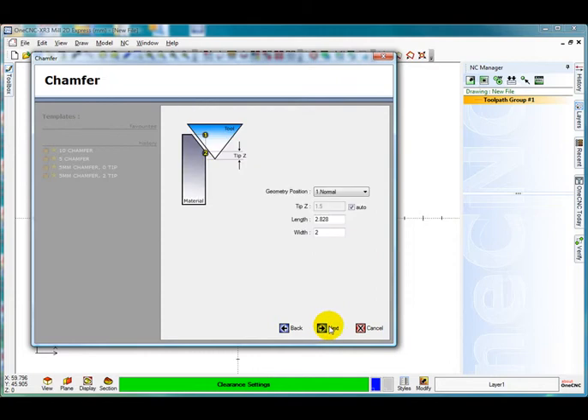Now this is the area in question regards the chamfering tool and what 1CNC does is it looks at the size of your chamfering tool. You can imagine that is the diameter and you have got 45 degrees — the angle down the side there. What 1CNC tries to do is find the sweet spot between the length of this chamfer here, so it can cut this 2mm chamfer and equally space it out amongst the length of the tool tip there.